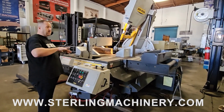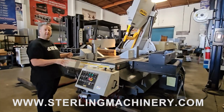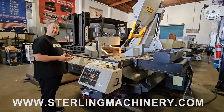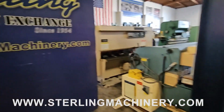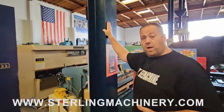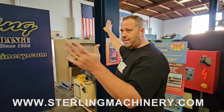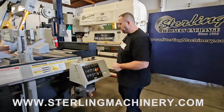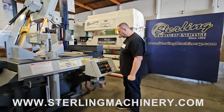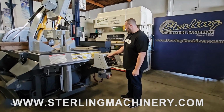Now you can add an automatic feed to this type of saw. You can add some large conveyors, some powered conveyors if you're cutting some heavy duty I-beams. Take a look here, for example. If you wanted to cut an I-beam kind of like this for structural type of materials, you wanted to cut a left and a right, that's what this is for. You got your tilt frame. Very, very simple and easy to use. We'll run it through again, let you see everything. We're going to close our left vise.